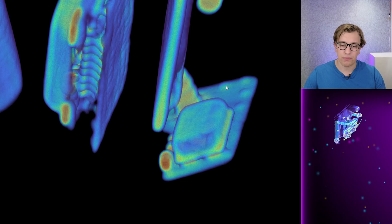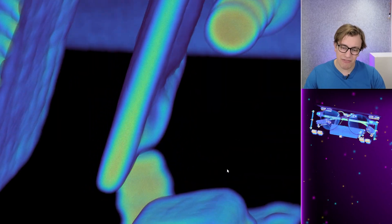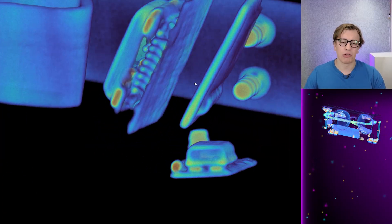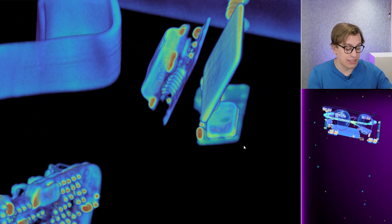That's all I've ever wanted in a device like this — I don't actually want full-color AR. I just want to be able to read text, and we're good. We also have this package down below, and I think this whole package might just be an accelerometer. Why would you want an accelerometer? It's actually dead simple: the way you interact with these things is by staring up at the ceiling until it brings up the interface, so you need tilt detection. The other thing the accelerometer lets you do is detect whacking the frame with your finger — like a tap to say "hey computer." Modern accelerometers actually have built-in onboard signal processing to distinguish a single tap, a double tap, or a shake, which takes a lot of programming burden off the developer.